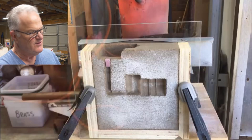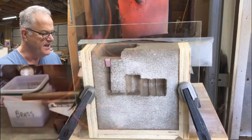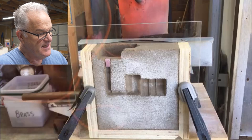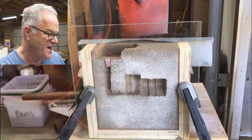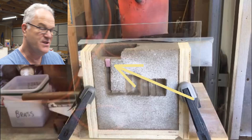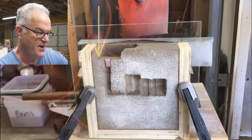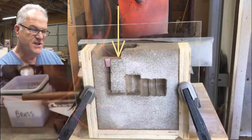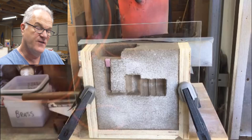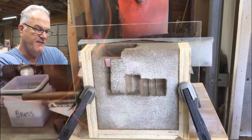Alright, so this is towards the end — about two-thirds of the way into his video. He's going to go into a slow-motion pour here. You can see his setup: he's got the glass in front of his mold, clamped together. Right in this area here he's got a foam plug in his sprue. The basin is behind that, and there's a ridge right across behind that plug. So he's going to fill the basin, it's going to come up, come over the top, hit that foam plug, dissolve it. You'll see the metal come down the runner, come across the mold, and fill the pattern. Let's go ahead and start this.